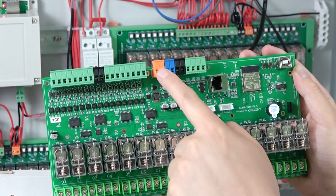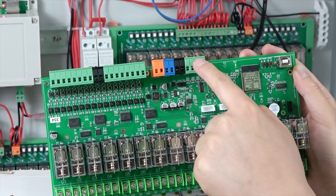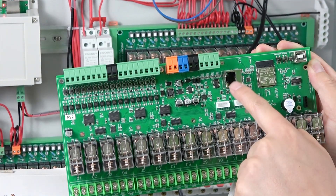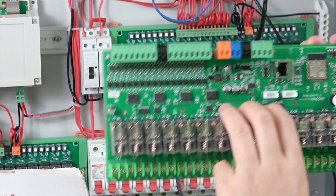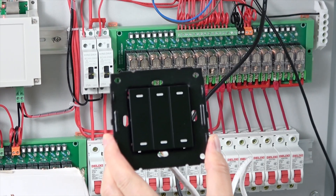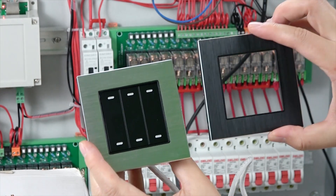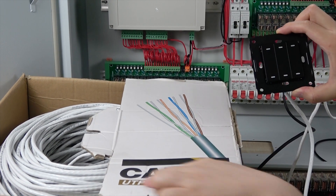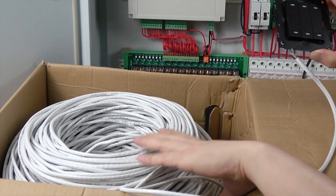This is the power connector and the RS485 interface running the Modbus protocol, along with ground, and analog input. I have connected this board with an Ethernet cable — not using Wi-Fi. It also has a speaker and a wireless receive module, so you can use a wireless switch panel. You can install different frame colors on the switch panel. I'm using a CAT5E cable for this setup.